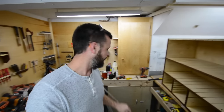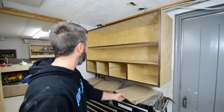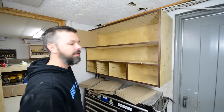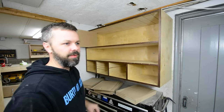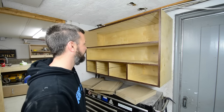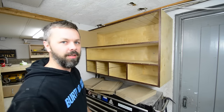See all these dividers? They even got little holes in them so you can pull them out. Yeah, they're too tight - they don't fit. So I actually just got back from the hardware store. This is quarter-inch MDF. I started measuring different material and quarter-inch masonite actually measures about a thirty-second less than this quarter-inch MDF, so I'm hoping that's going to solve my problem. Par for the course with this cabinet - nothing's going to work out right. So I'll go cut out a whole new set of dividers.